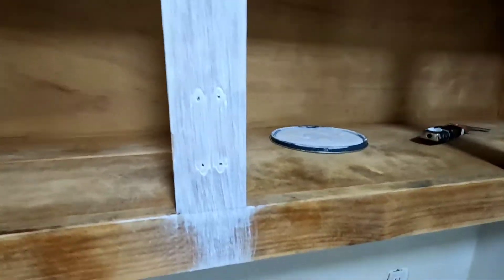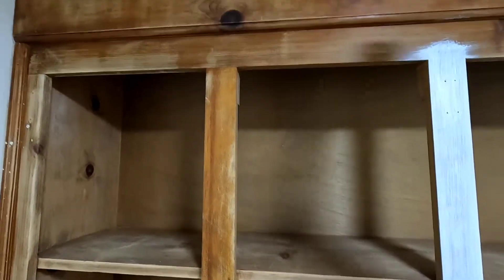I'm just filling in the front and going with the grain — the grain in these columns runs up and down, while the bottoms and tops run side to side. At the end of my finished strokes I go with the grain. This is just priming; I don't need 100% coverage of the wood, so don't be afraid if you can still see some wood through the primer — it's perfectly fine.